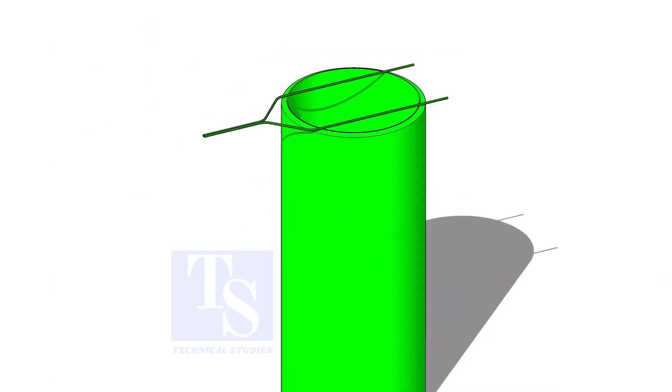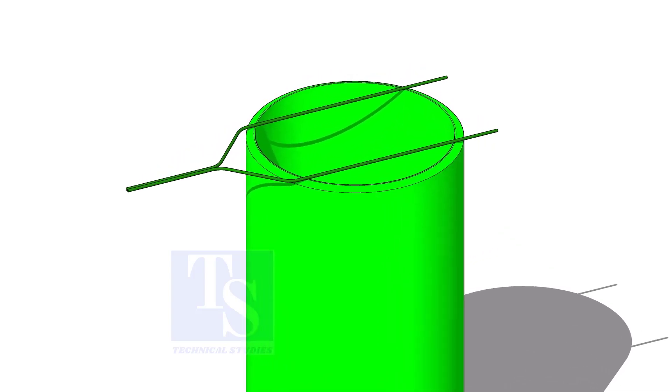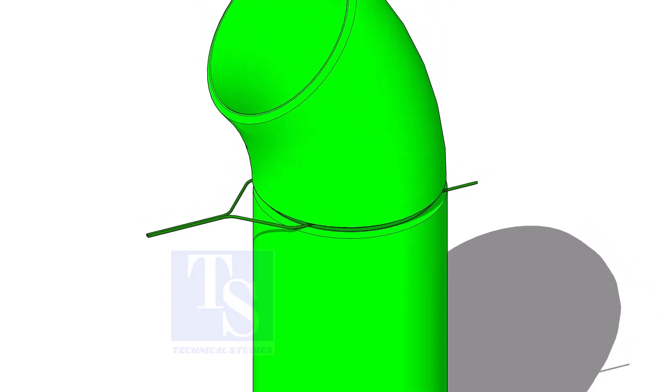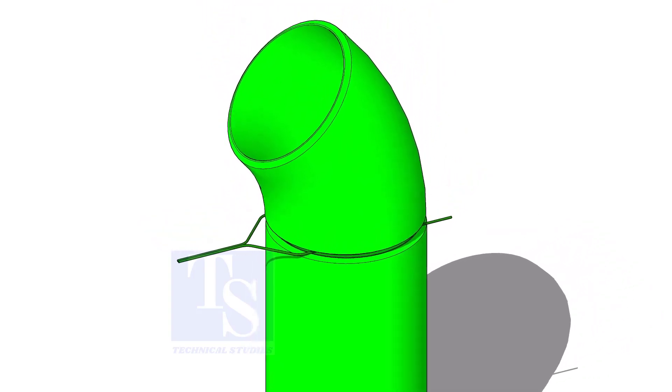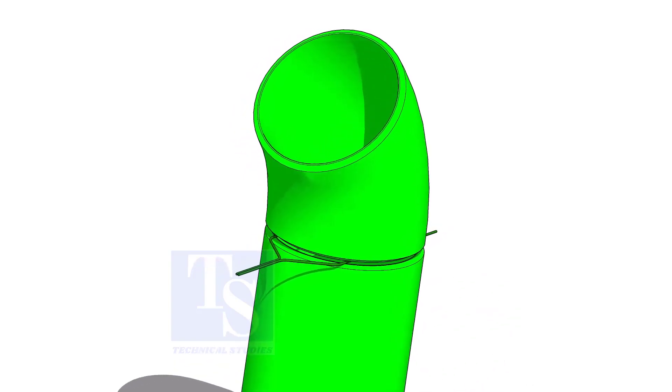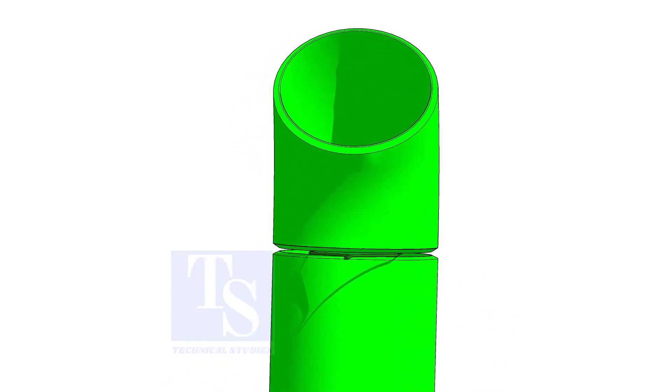You can fit up this spool in any position because the pipe is short. Put it in the vertical position, put the gap rod and the elbow on the pipe, and tack weld on both sides of the joint.